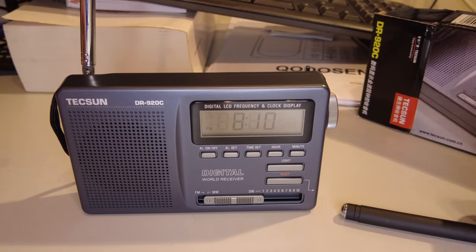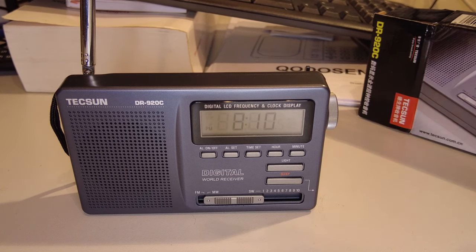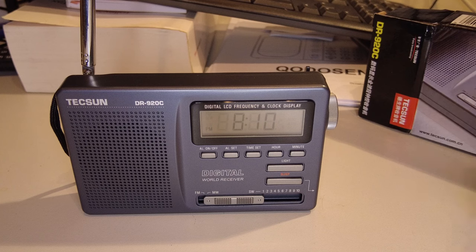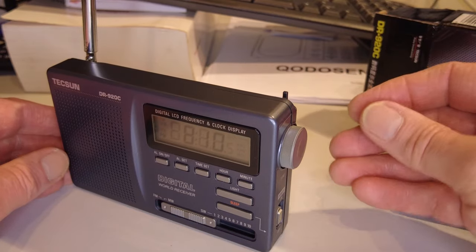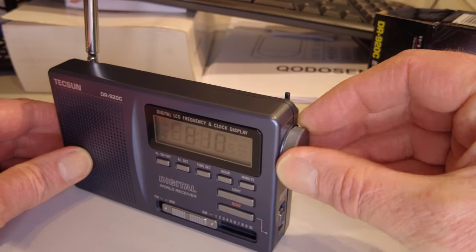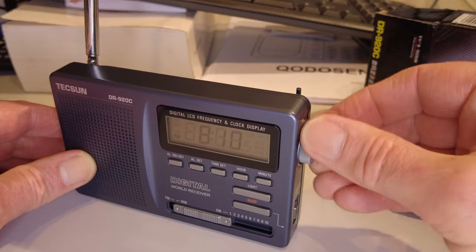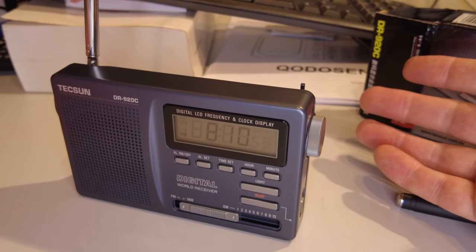This was £23.45 delivered from China, so it's a bargain basement radio. It does have an LCD digital frequency readout, but it's an analog radio — an analog radio with a frequency counter attached to it — so it's going to tune like an analog radio. It shouldn't chuff when tuning, but it does have limitations in other ways. The tuning control is like a dial and pulley, like an old-fashioned radio with a variable capacitor, and you can feel that in the knob — it feels a little different from the synthesized DSP radios Tecsun normally produces.